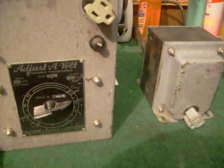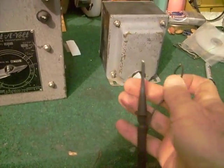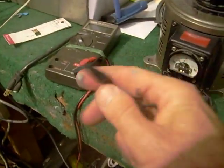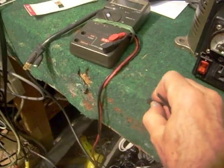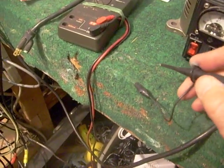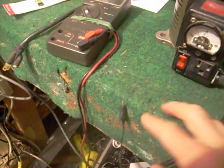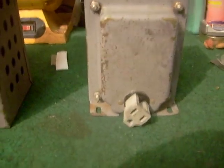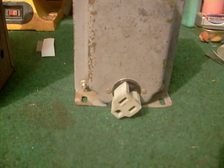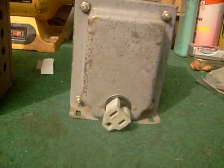When I first got started in electronics you're always supposed to use one, especially with test equipment. For example, if I'm going to test something using my oscilloscope and I hook my ground lead to the chassis of the TV before testing voltages — what if that chassis was hot in relationship to my ground? You'd have a problem and could blow something out. That's the main use of an isolation transformer, and this principle of isolation will come up in some of my other videos where I'll go into it in a bit more detail.